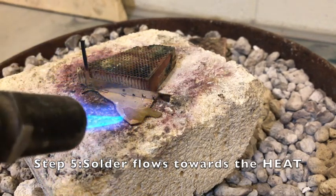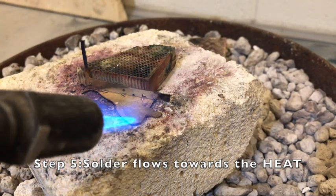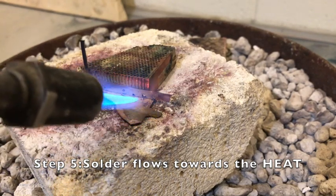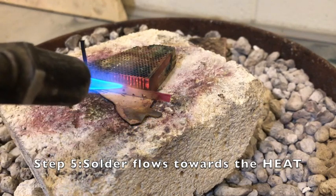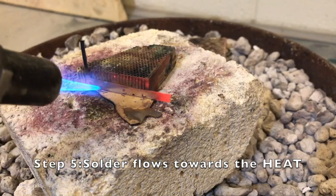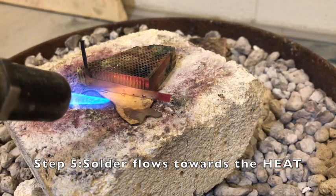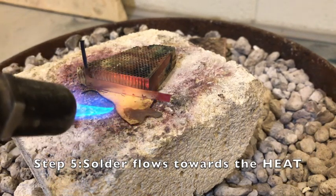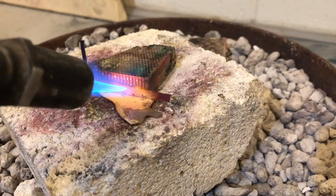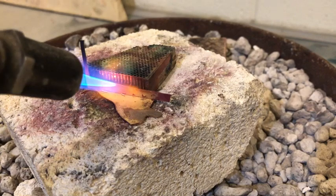As you're heating, you're using the hottest point of the flame. So if you notice, I can see the tip of my flame and it's just touching that metal. I'm watching the surface color of the metal and I'm noticing that it's darkening. And in some circumstances, like right down here, it's turning bright orange. But I need to bring both pieces of metal to temperature. Since this is my larger piece down here, I'm going to focus a little bit more of my heat down in the bottom part. Always moving that flame.